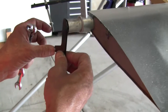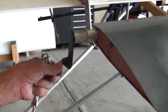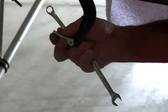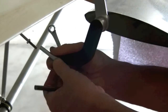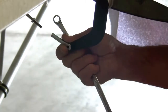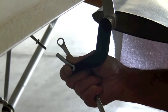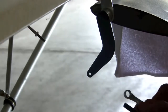Then you measure here and put your clevis and the extension that you need on it. This is the angle that it sits at neutral. This will be your clevis — that's what's going to go here. Keeping in mind you're going to go 90 degrees. So what I'm going to need here looks like is just a short extension — I've got a long one here. I'll have to get a short one. It looks like a one-inch or inch-and-a-half extension.